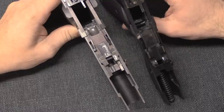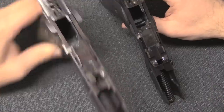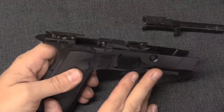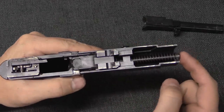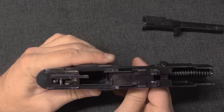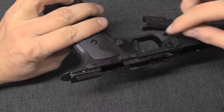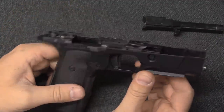Off camera when we were putting these things back together, it is in fact a huge pain to try and line up - you're trying to hold the trigger, the slide, the barrel, and then line up the recoil spring by holding it right side up and kind of jiggling it. The way you did this is pretty cool - at this point you actually have a whole removable chassis inside the frame, kind of akin to some of the modular pistols just coming out now. It's the chassis that actually locks this recoil spring in place. Field stripping is take the slide off and you can spray it down without having to get to your recoil spring except to spray it off.